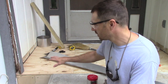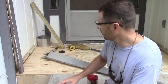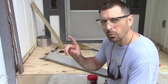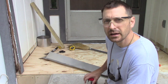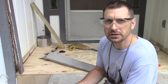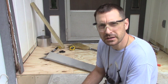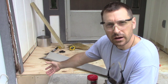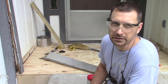Now that we've gotten our damaged structure and damaged subfloor replaced and taken care of, we actually did pull back our trim. We've got our flashing bent. But what we're going to do before we attach the flashing here in the front is we're going to apply a coat of Red Guard underneath the flashing. That's just an added extra layer of protection. We're going to add that coat underneath the flashing, kind of push that flashing in there — it should adhere to the flashing. Nail down the flashing. And then, after that cures and dries, we're going to come back and put another coat of Red Guard over the entire space, including the flashing on the top.